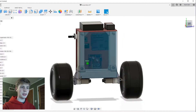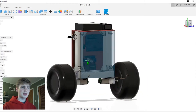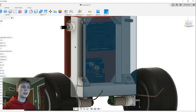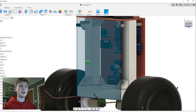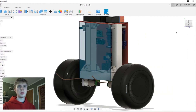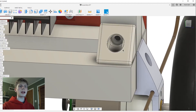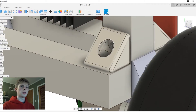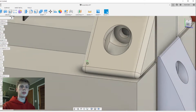Here is the final design. The chassis is made out of 2020 aluminum extrusion — I really wanted a durable, rigid frame, and aluminum extrusion commonly used in DIY 3D printers is modular, lightweight, and durable. The frame is held together using 3D printed brackets for the 2020 extrusion that I made in Fusion 360, and I think they turned out pretty nicely.